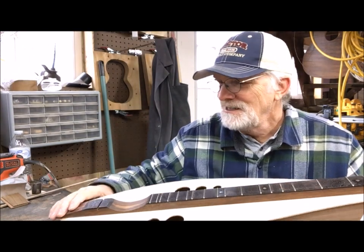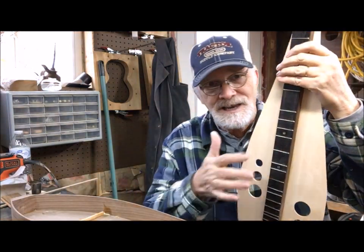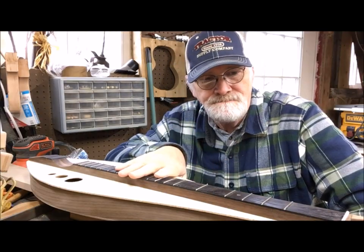I've got my secret top bracing done on the inside — you don't need to see that. We work really hard to make our instruments sound as best as they can. Some folks think bracing is for added strength, but the reality is that bracing is what you use to coax as much sound and texture out of an instrument as possible. We tap tune our tops, which is a long procedure of tapping, sanding, and getting the right thickness. Then after I put the braces on, I do the same thing and carve my braces accordingly, trying to get that same tone to my ears.